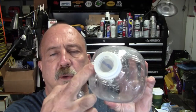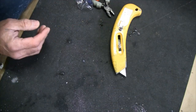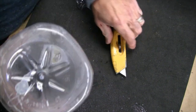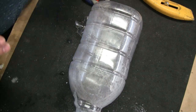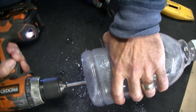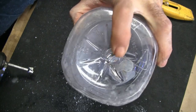I need to drill a hole inside of here. I'll let the hot glue finish solidifying and then drill a 5/8" hole just on the inside of that cap so we'll be able to change barrels. The last thing I'm going to do on the combustion chamber is use a Forstner bit and drill it to 5/8" so that the 5/8" hose can go in there snugly, then hot glue it in when we're done.